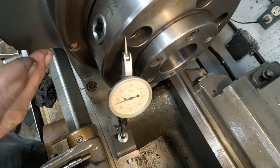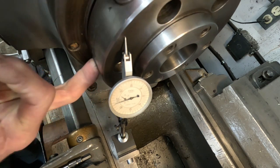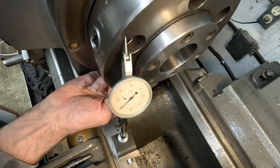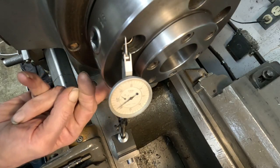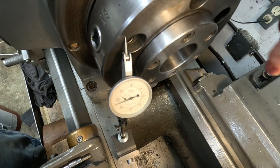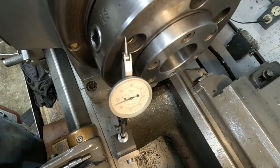I'm checking this out because it's taken me quite some time to get these spindle bearings adjusted, because they were run loose for quite some time. This lathe is 84 years old — quite amazing. Now this lathe has four Timken bearings — it's a heavy duty spindle. The Monarchs of the same time period, 1940s, would have only two Timken bearings on the spindle. This is a heavy duty machine and its load specs are 27,000 pounds radial and 11,000 pounds axial.